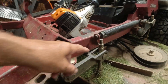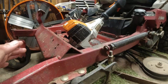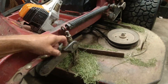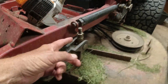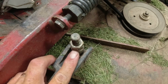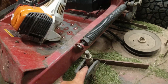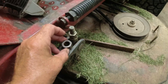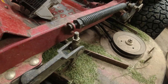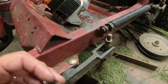I can't move this any further down to bring the front up either. So what I'm going to do - and we're just going to try this out because we got some big cuts tomorrow - is I'm going to put some spacers in here underneath. I'm going to take this bolt off, back this thing out, and put a spacer underneath. I'd like to put two under there but I think one might do it.